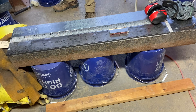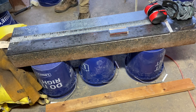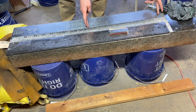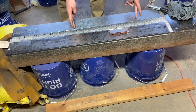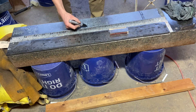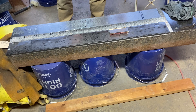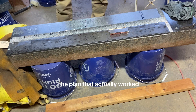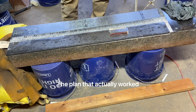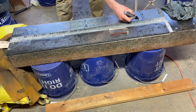It's been a couple of days — I've been working on this a few hours every day. Basically I started with the first 18-inch section and then moved about an inch or inch and a half over each time. I'll have dye at one end and dye at the other end of the plate because the whole plate is at an angle, only contacting on two sides since one spot is very high. I started at a downward angle to guarantee the end spot would be high, then continually took passes in that one-inch section until I got full contact again, then moved to the next section.